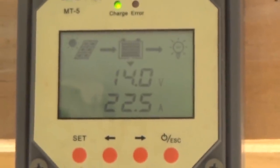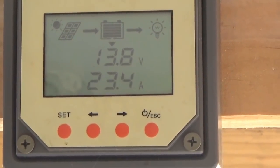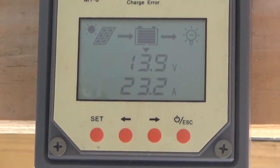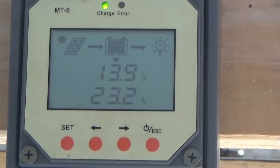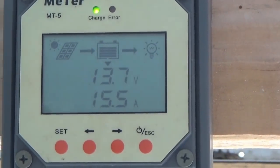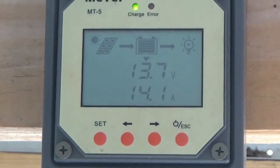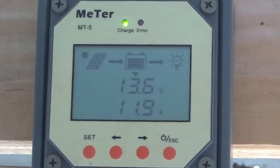This is what it's all about — I just had 24 amps coming in here, 23.4 amps. From two solar panels I have about double: the max I was getting before was 13 to 14 amps. So I'm hitting almost double now by moving this outside. There were clouds passing over — we just had some sprinkles of rain — and that right there is the most I've ever seen inside: 14 amps on a sunny day.